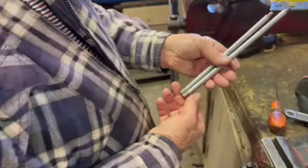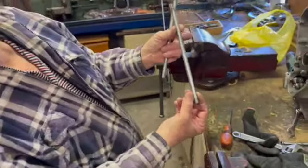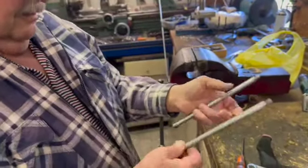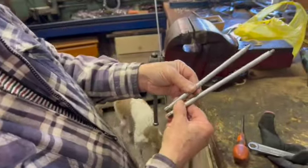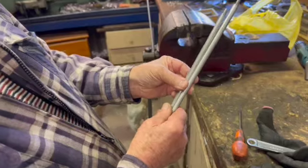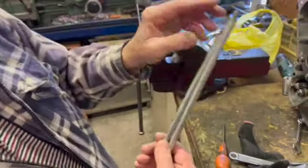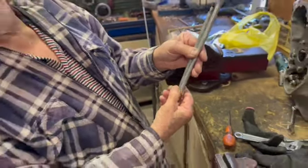So these are the push rods that I'm making for Ian's bike. That's pretty much a standard length one, out of just an ordinary old standard Mac. Now, because of the higher compression, because we've shortened the cylinder and everything, we've got to shorten the push rod accordingly. But the ratio doesn't always come with how much you take off the barrel and how much you take off the push rod, because who's saying the push rods were right anyway?